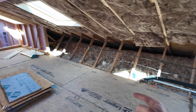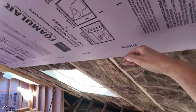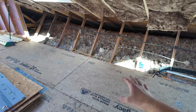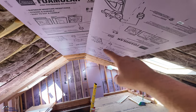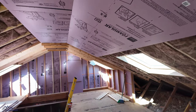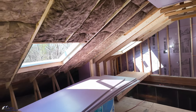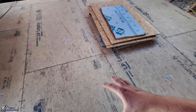Eventually there will be a knee wall that comes up here. We're going to build the knee wall and abut this one-inch rigid foam into a half-inch layer of rigid foam that will go all the way down to our subfloor. Essentially you're going to have one continuous air barrier all the way around this space, and that's really what's going to help carry the load to cool and heat it.